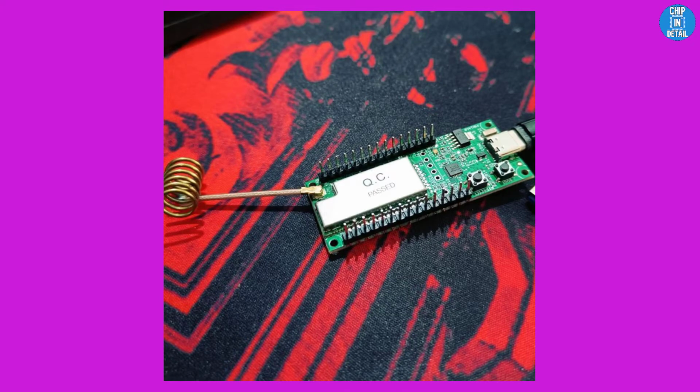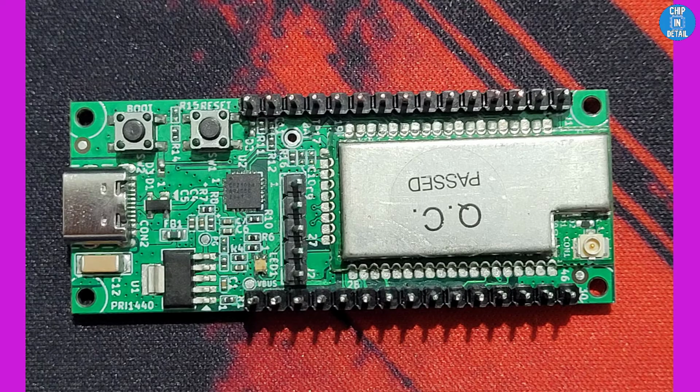Thankfully, the LoRa Arduino compatible EVK is configured in such a way that you don't need an external programmer to flash new code using Arduino IDE or STM32Cube IDE. You can directly flash the code through the USB like any other Arduino board or ESP32 board. The board has 4 screw holes on 4 corners to easily mount or secure it anywhere.